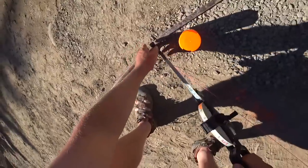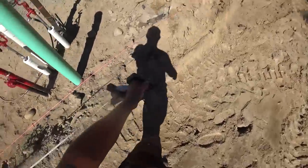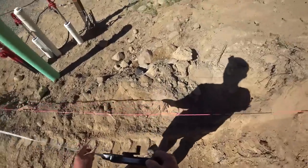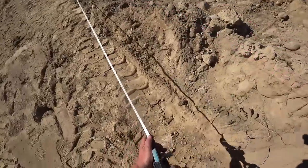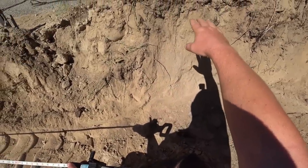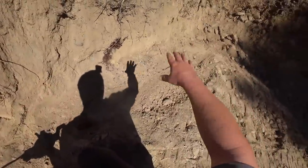And now I need to grab some information on the step down footings for the ICF company, which will help us determine the number of blocks that we'll use for our frost wall. The way we're building this footing is to conserve resources, but still provide ourselves with plenty of frost protection. Where the hillside starts here, pretty quickly we're over 2 feet deep, which is the frost depth here for footings. So there's no need to put a frost wall back here.